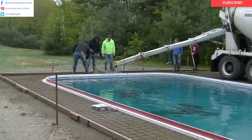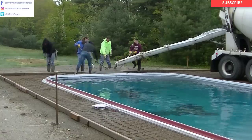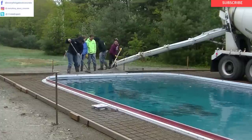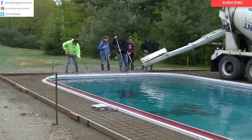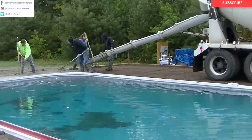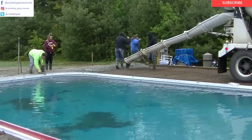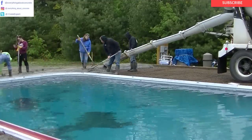We're starting this pour now, starting up on the thin end — the four-foot-wide end. We're going to pull the concrete back to right around that corner, and that's also where we're going to start stamping. When we're pouring this thing we've got to keep in mind how we're going to stamp it. It's two loads, and in case the two loads don't dry the same, we always want to keep best practices for stamping in mind. It's a 4,000 psi mix, three-eighths stone — we like using the smaller stone when we stamp, it makes stamping a little bit easier.